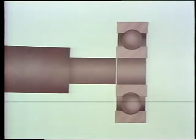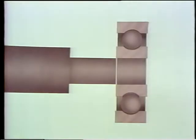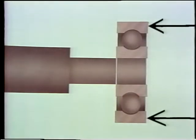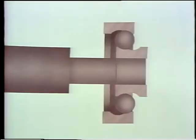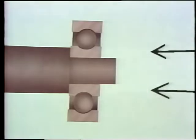Now, one way to prevent brinelling is to make sure that the force you're applying when you're installing a bearing only touches the ring that is being mounted. Say it's an inner ring being press fit to a shaft. If the force applied during installation touches more than the inner ring, say it extends beyond it to the outer ring, brinelling will occur. By restricting the force to the ring that is being mounted, you eliminate the problem.